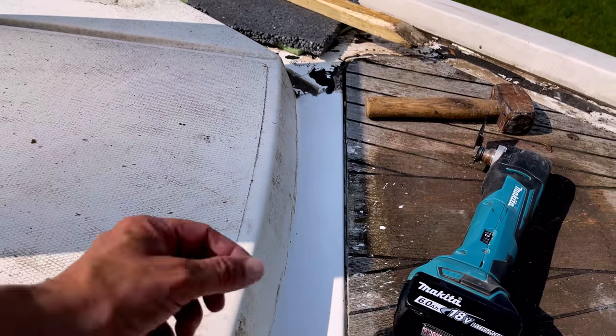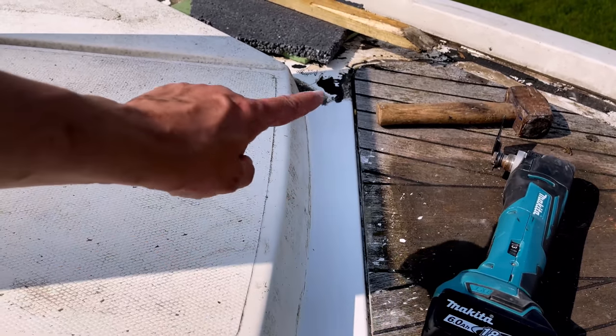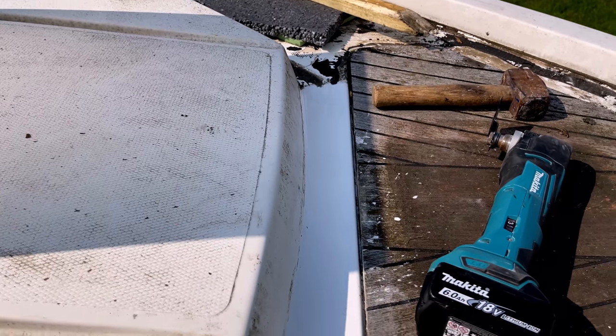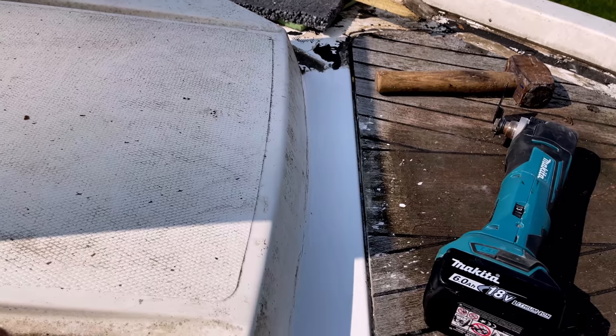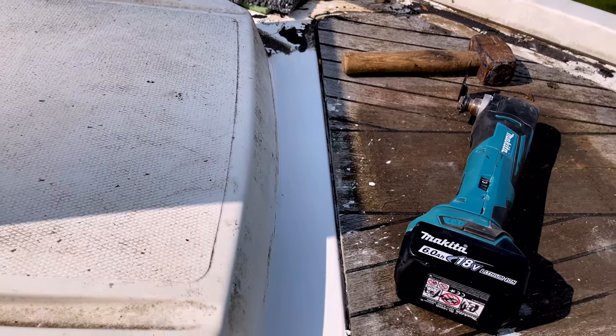And I've also just come in and sanded all of these gel coat repairs here. So if you remember from the last video, we left like a little dome or bubble on it, so I've just flattened that off. I think there's about 6 holes across the front here now. I can barely see them, I'm struggling to find them. The only one is just this one here, that when the camera picks that one, that's got a bit of an outline, but that's fine.